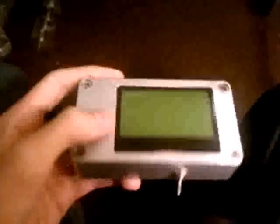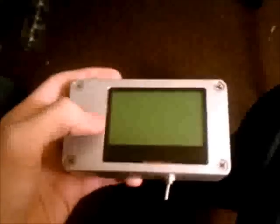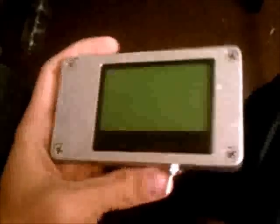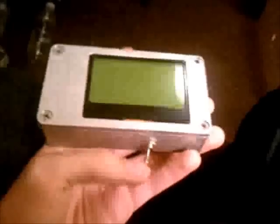There's a little board that Adafruit Industries makes that charges LiPo batteries over USB, which is pretty cool. And the graphic LCD is 64 by 128 pixels, so that's kind of nice. I had to mill out this little aluminum enclosure I got for everything to fit, and I think it turned out pretty good. So this switch right here, unfortunately I had to add an on-off switch.